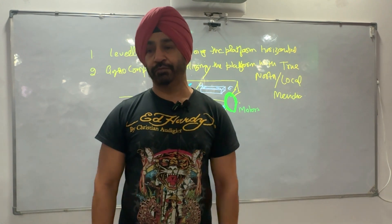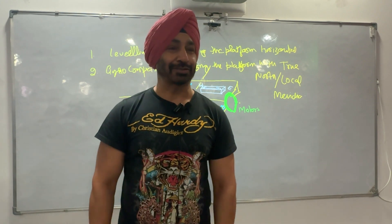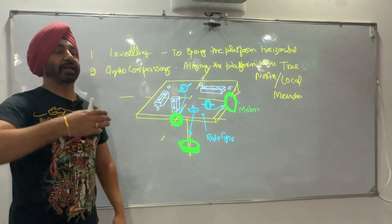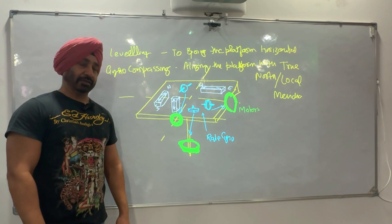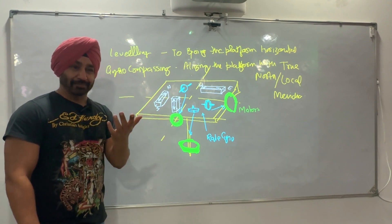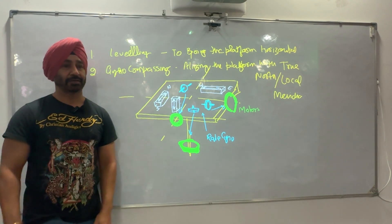Later on GPS came and computers improved. You can have on the same data bus both INS input and GPS, so you don't need to give an initial position manually. Now GPS is checking IRS and IRS is checking GPS — they are talking to each other. They started using it for navigation extensively. It had an error of drift because of rotation of the Earth, but we will not talk about that here. They realized this is a wonderful platform to create PFD indications — you need indication for pitch, bank, and roll. What better platform can you have than this? So from this system they started giving input for the EFIS display as well. You don't need a separate sensor. If your basics are clear, things become very simple to understand what is happening in the system.